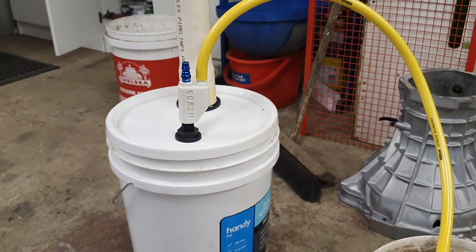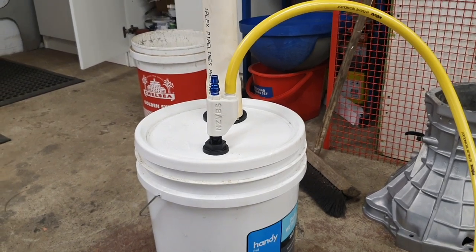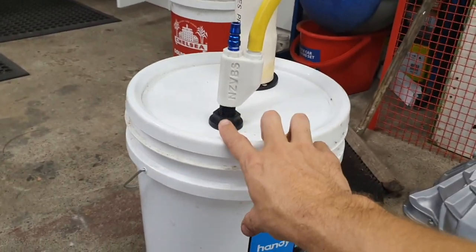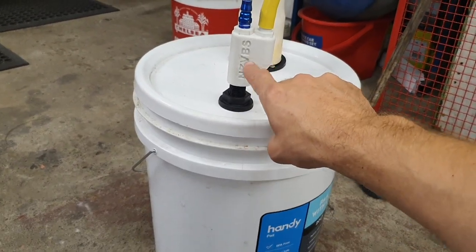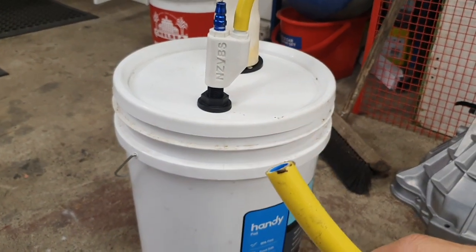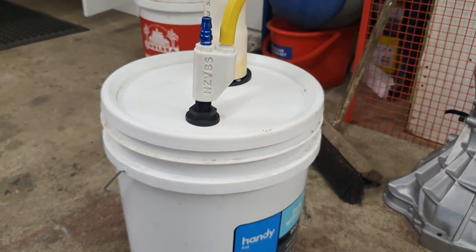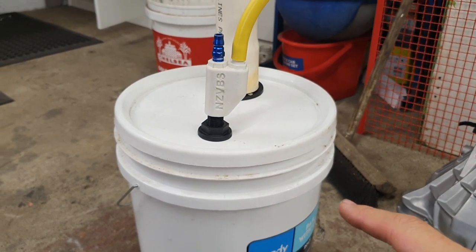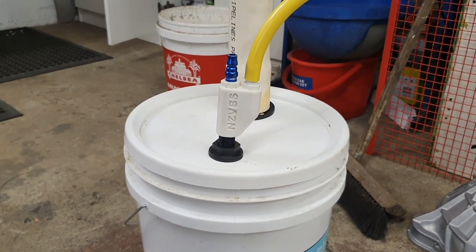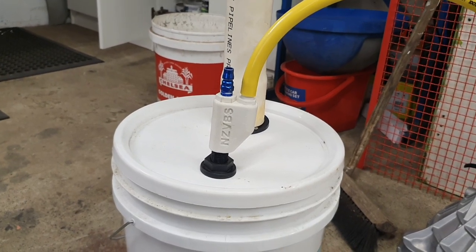I initially was doing this sort of thing to test the nozzles that I made originally, and the idea was that if the air rushing through the end of the nozzle was working properly, that should create a low pressure zone in there, in which case it would draw up the water from the other end of the pipe. So I initially built this kind of setup. It wasn't exactly the same, but similar to this, just to make sure that it was creating that low pressure zone properly and that the nozzles would work without backfeeding. So that was how I came up with it.